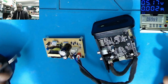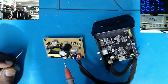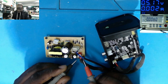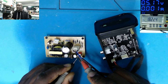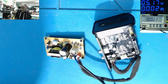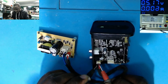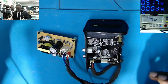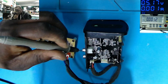So how do you diagnose something like this when we have some kind of power issue? We have to separate whether the problem is coming from the switching power supply or from the digital board. I'll check the output of the switching power supply — plus and minus 18 volts. So this power supply is good; voltage is present on the output. The problem is definitely not the switching power supply. On these output wires we also have 18 volts.